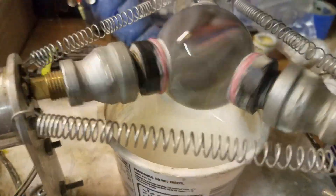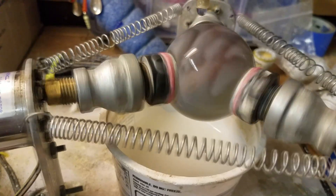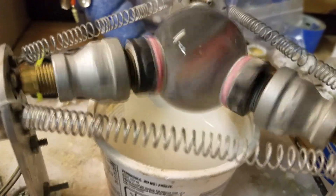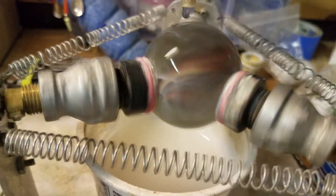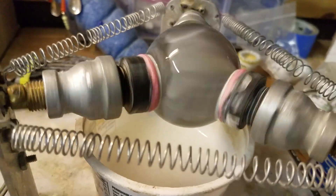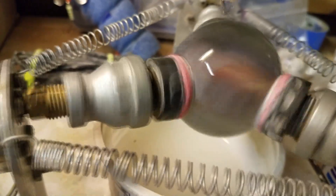Here's what it looks like with the 400 grit cups on. They're a little bit smaller than what I want, but they're actually moving the marble around really well. Ideally if they were just a quarter or half inch bigger they'd be better, but these are doing just a fine job, so I'm going to let that run for probably 30 minutes. That should get all of the remaining 100 and 200 grit scratches out. You can see it's filling up with slurry on there, and that's good — it means it's cutting the glass and getting those other scratches out.